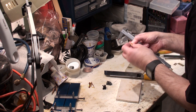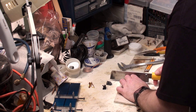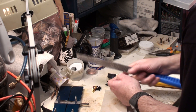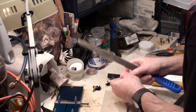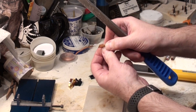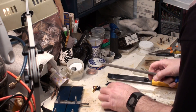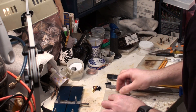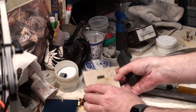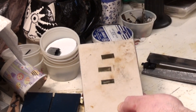Let's do our measurements. As soon as you start along the line, just keep working, filing there. That's sitting pretty flat — got a little bit of a high point there. So we have three plates. Now what we have to do is make sure that we find the exact center for each of these plates and punch a hole. So that's what we'll do next.